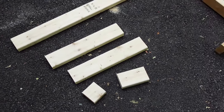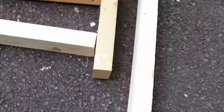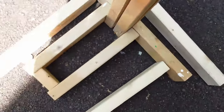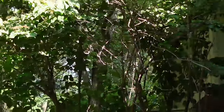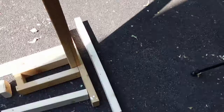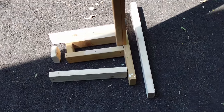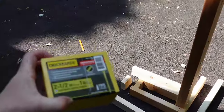There are the five pieces we need cut from our 2x4s. This is going to make up our cross piece for the base. I'm making this a little bit longer, and I'm going to extend these guys out. I have a spacer that's going to sit at the back, and then I have something that I used as a stop block — it's going to just prevent the canvas board from rising after a certain point. So the first thing I want to do is pull together the foundation. I'm using some reused deck screws from a previous project — 2.5-inch deck screws.